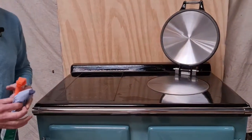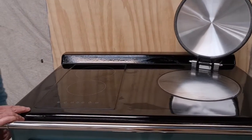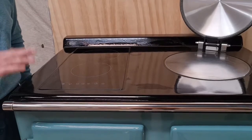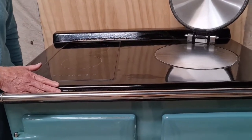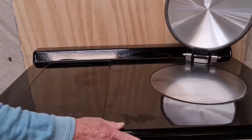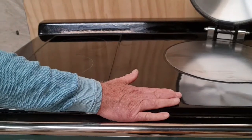The finish is a full vitreous enamel. Not enamel paint or high temperature plastic powder coating. Vitreous enamel is a layer of coloured glass melted over the iron at 800 degrees in a kiln. That's why you've got this beautiful, tough gloss finish.